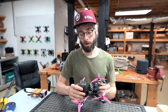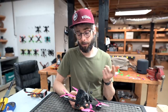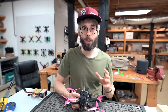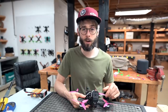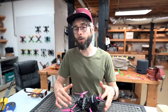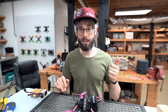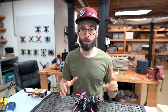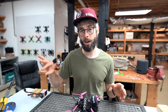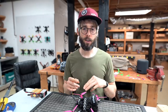With quad electronics, if something's broken you'll usually see it or notice it - the video transmitter doesn't work, it's touching the ESC, a motor is burnt, or one motor doesn't spin up, which tells you an ESC is probably broken or there's a firmware issue. I like to group things into FPV stuff - video transmitter, camera, VTX antenna, OSD board - and flight control stuff: ESC, flight controller, RC receiver, and motors.